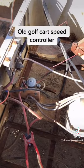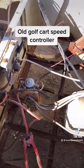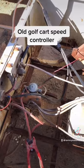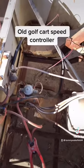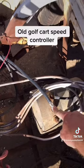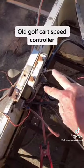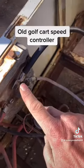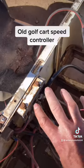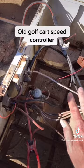The first thing you probably want to do is forego trying to get reverse to work and just get one direction working. That adds a pretty big level of confusion, even for me. Putting these motors in reverse is not as easy as just switching the polarity on them — they always have these reverse switches here, and sometimes it's a solenoid-based reverse switch. So sometimes just forego that for now and let's just try to get it moving.